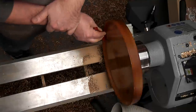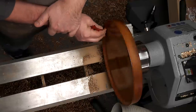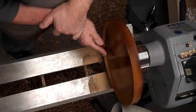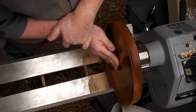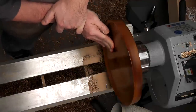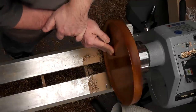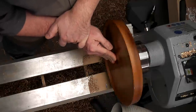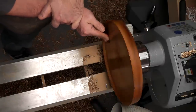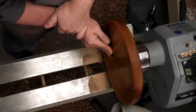And all we're doing, the nap of the grain now, those little fibers are just rising up. We're then sanding them in. At the same time, the dust that we're creating is mixing with the oil and creates a slurry that fills the grain. That's why you get the silkiness afterwards. And the other thing with traditional wet sanding, you won't get those fibers sticking up again, so it'll stay smooth for a long, long time.